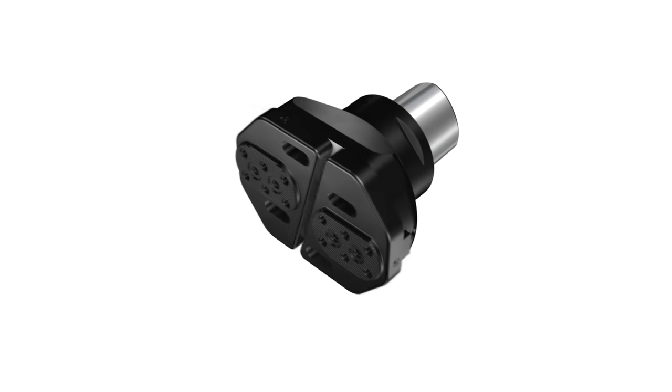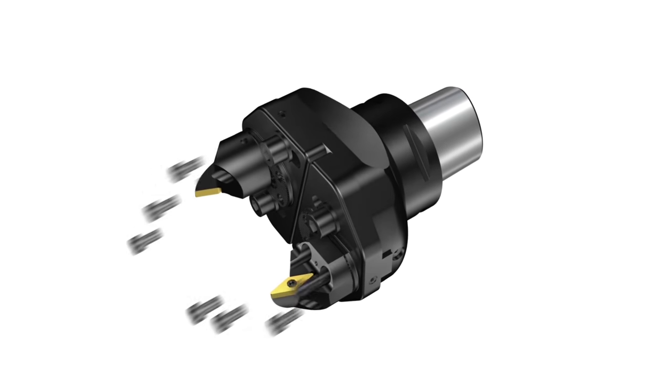Many conventional methods for machining API seal ring grooves have poor process security and slow down production. Conventional plunging and radial turning tools are used to perform roughing and finishing in multiple operations, resulting in high cutting forces and limited tool life. In this episode, we will demonstrate how to solve some of these machining problems by using a completely new approach: milling the grooves using a boring cutting tool with turning cartridges and inserts.